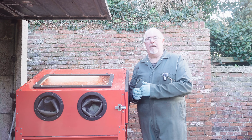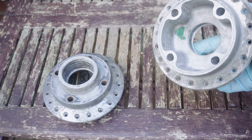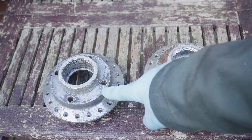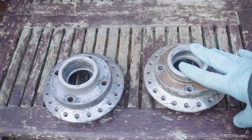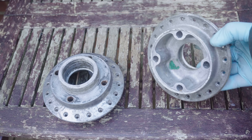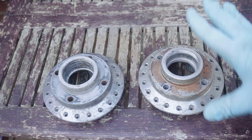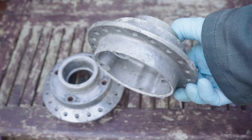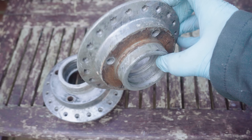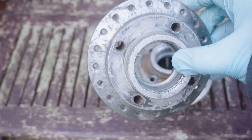Once I've got it going and it's running through, let's have a look at what I'm going to do this morning. The two things I'm going to show you are two parts of the rear hub. I've already degreased them using white spirit and given them a good scrub over, but if there are lumps of things the blasting probably won't take that off — you may have to give it a scrape along the way. On this one, where it's obviously the brake side, there is rust staining around here. This isn't going to make it perfect, but it will definitely take all the corrosion and marking off, and by the time I've finished they'll have quite a good finish. They've obviously been polished in the past, and yes there are things far worse than this, but I'm looking for a clean finish.